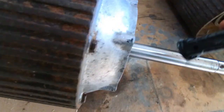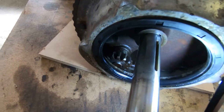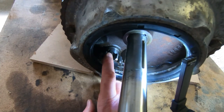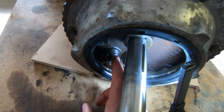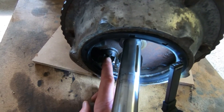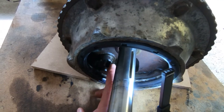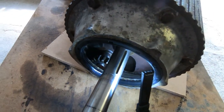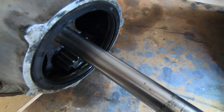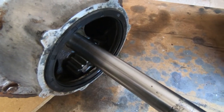And then on the other end there is just a single gear. It's the same gear as the other end, but it's fitted on in the opposite direction, so that brings the teeth to the outside. That meshes with the gear on the drum on the roller at this end, but because there's no second gear, this roller rotates in the opposite direction relative to the roller on the other end. So it gives you the ability to turn corners and drive the rollers on each end in opposite directions. So it works in a very similar way to a car differential.